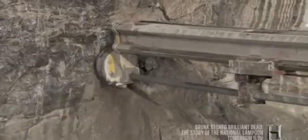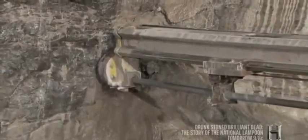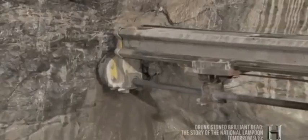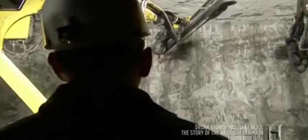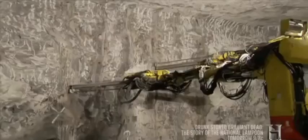In just a minute and a half, the drill penetrates 18 feet into solid rock, a length slightly longer than the height of a typical single-story home. From inside an enclosed cabin, the drill operator controls both arms simultaneously, using a pre-programmed computer console to guide his appendages. He has a joystick in the cabin, just like a video game that you have at home. So you have a joystick, and it will locate that boom to the next hole in a precise area and a precise angle that he wants to drill out to. And once he's done that, he'll start the drilling cycle again.